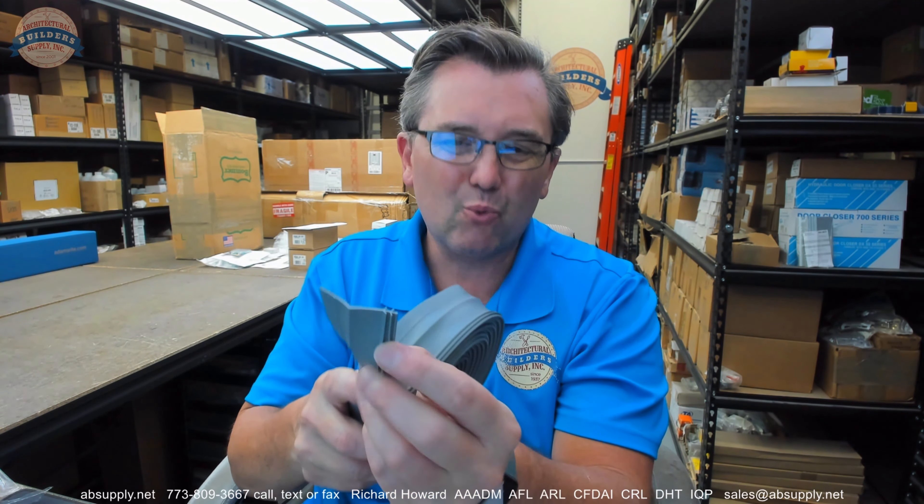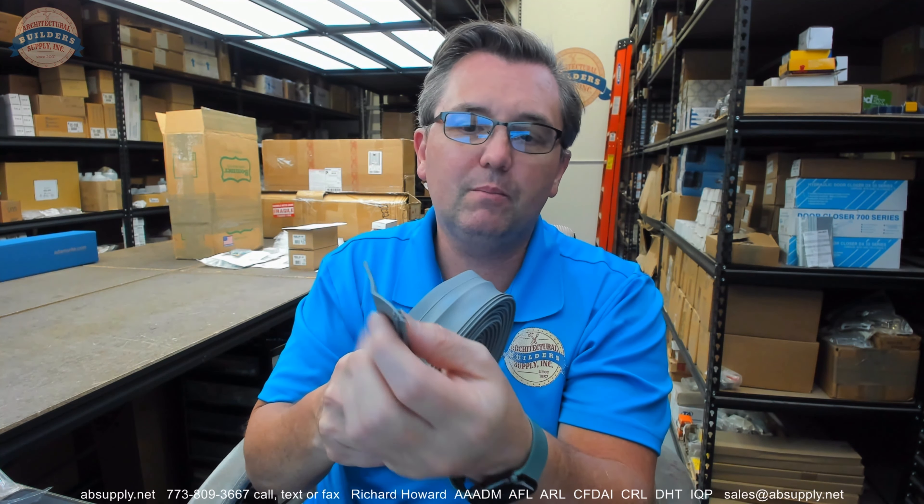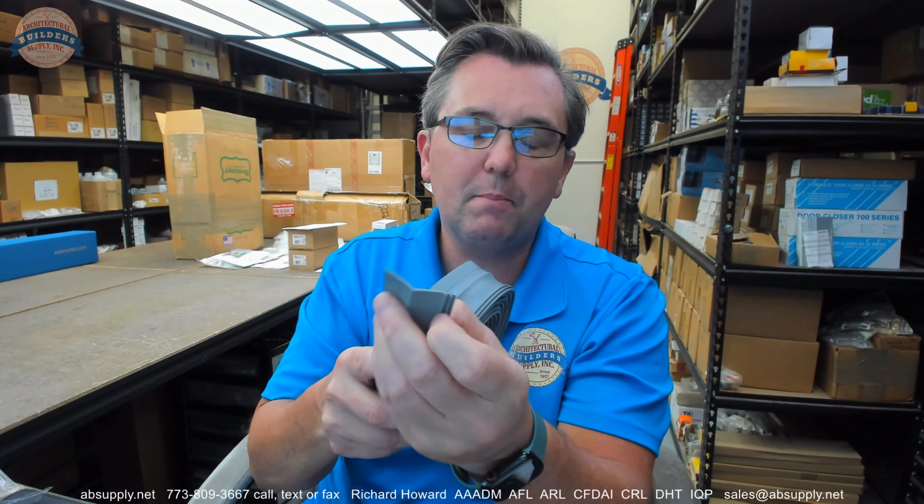I will often see people install angled material on overhead doors that are either vinyl or sometimes bristle, and bristle is very effective as well. What's nice about bristle — which Pemco makes — is it's available in longer lengths. So if you have a larger door or an embossed or textured finish door, you might want bristle because it will fill in those surfaces better. A leading edge of vinyl might be a little less capable of tailoring itself to a textured surface.